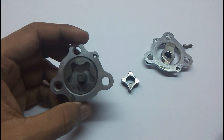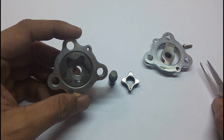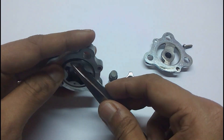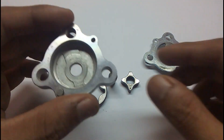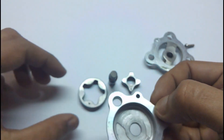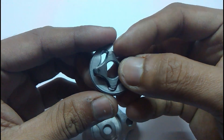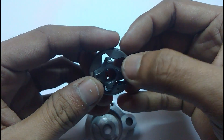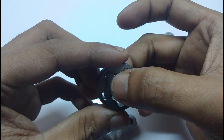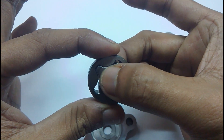The small gear is very easily taken out and there is the shaft. There is the outer gear. There is no bearing or anything else inside — all the parts slide over each other. The entire assembly is soaked in oil, and that's why it doesn't need any bearing; it just slides along.